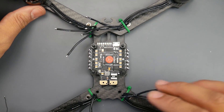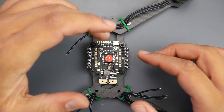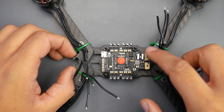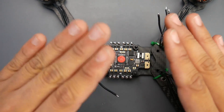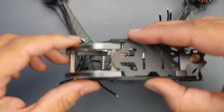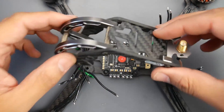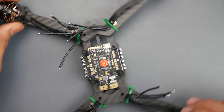So the motor pads are done. You may have noticed that I have the flight controller put in backwards in the frame. This is usually the back, but the positive and negative battery connection pads were barely touching the carbon fiber, and you never want that. Since the frame is symmetric and I can put the top plate either way, I've gone ahead and flipped it — making the back the new front. So that's why I did it this way, not a mistake.